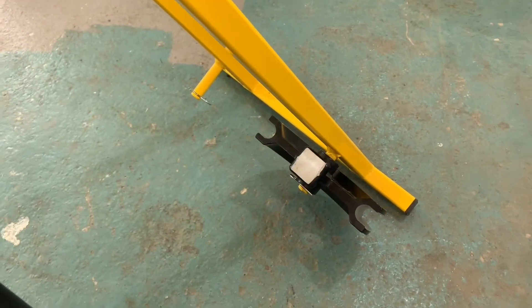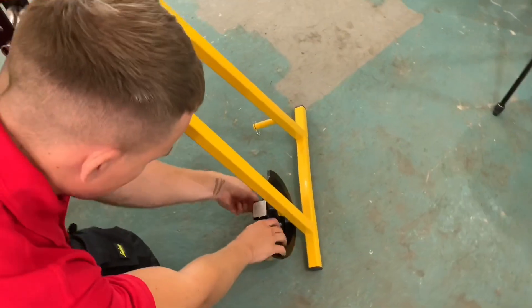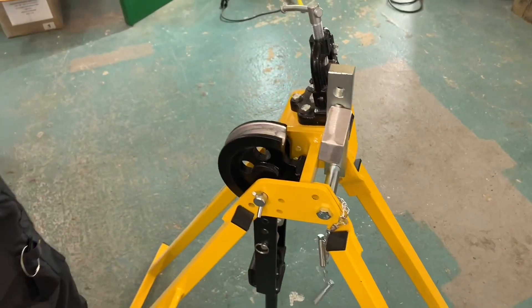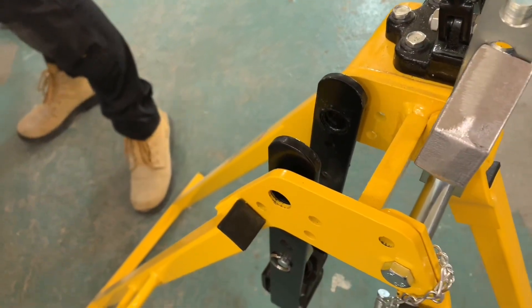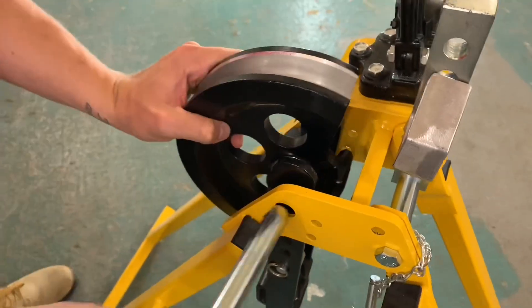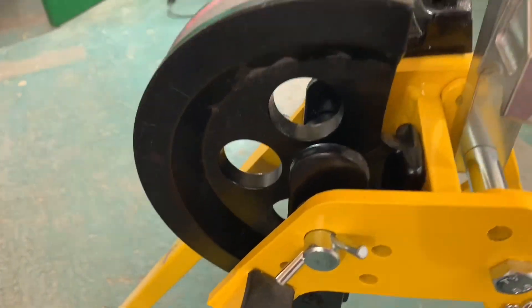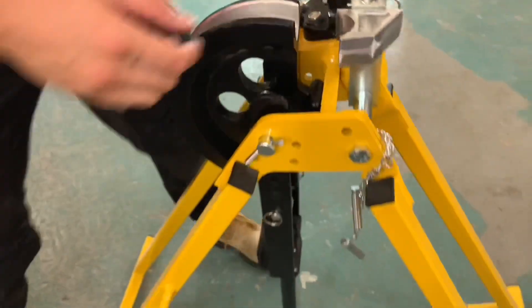The former was a 20 mil — I noticed there is another one attached to one of the legs. Yes, we've got a 25 mil former down there, really easy to swap out. That simply slides out — easy as that. So now we're ready for 25 mil. It might be the case now that you move your stop up one position as well.